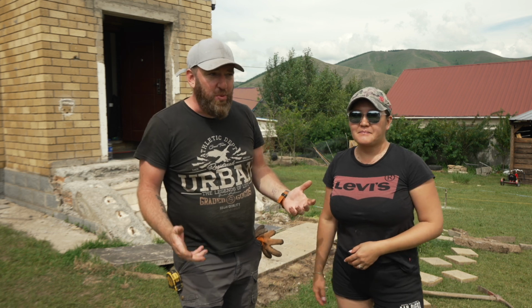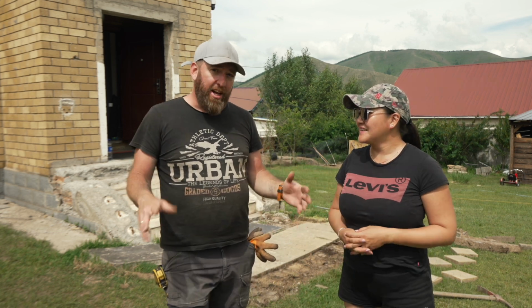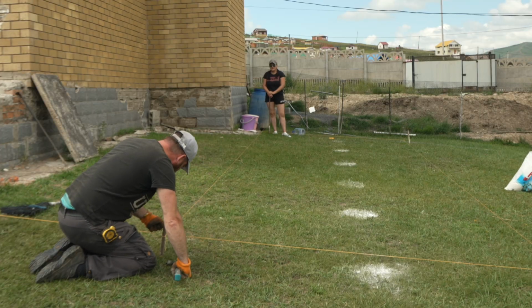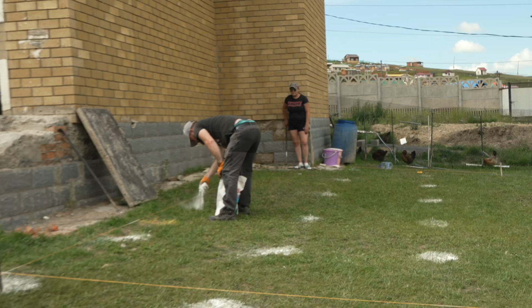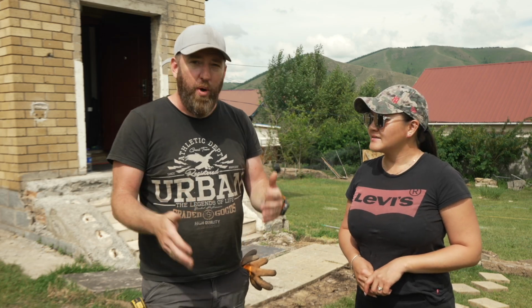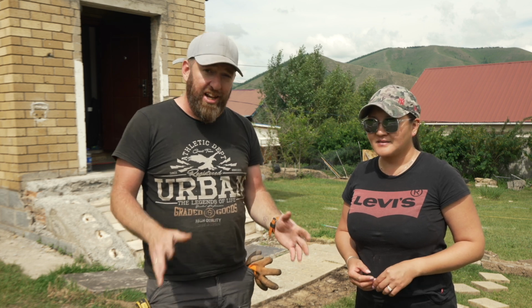We are cracking on this week. The weather has definitely improved. Finally, we're starting on our deck build. This morning we have been squaring everything off with a string, marking where we're going to put the holes. Because this is not a traditional square build, it's a 3-deck system, so it's a little bit complicated.